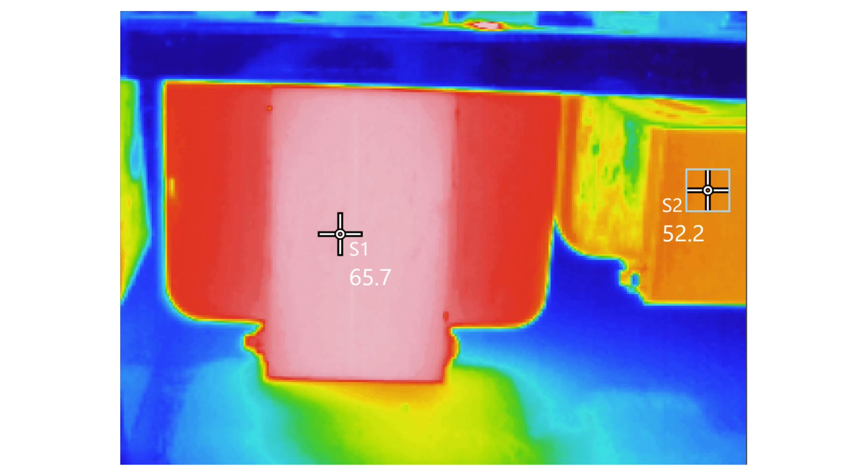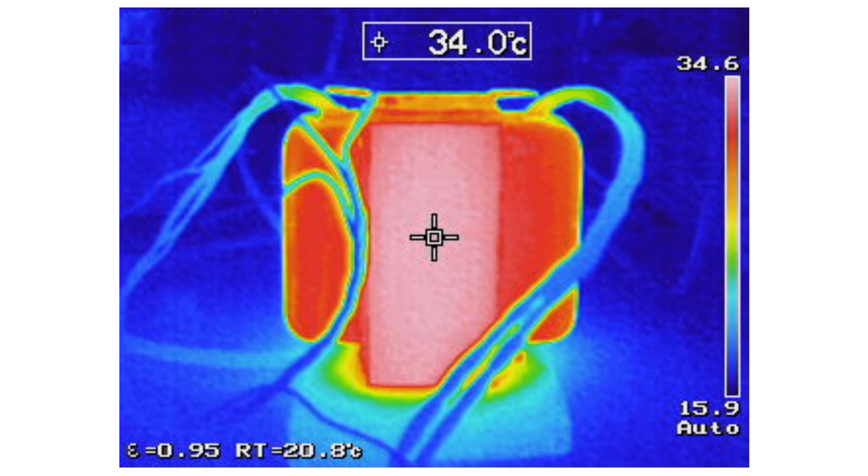This is a wider picture showing the S2 heater transformer — it's a good 10 to 14 degrees lower in temperature. And this last plot is a spare transformer just running on the bench with nothing connected — no load. We can see there's nearly a 15 degree rise with no load, just from the power being dissipated to magnetise the core. With the amplifier connected and that extra load, the extra winding losses contribute to higher power and higher temperature. We'll continue and make some detailed measurements of the distortion.